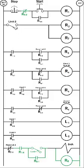The cylinder starts to extend. It keeps extending. When it fully extends, it hits this limit. When that limit closes, now these guys energize again. Let's take a look at what happens here with this memory latching stuff. So when this energizes again, this is going to become closed. Now, this time, when it becomes closed for the second time, what happens is this is already closed because that is the done bit. That's the 1 count. So because that becomes closed, that is now the memory latch, and it's remembering the fact that the cylinder has gone out for a second time.